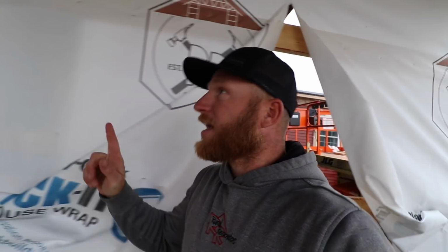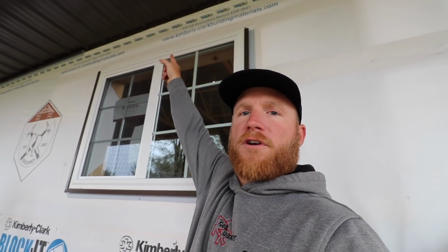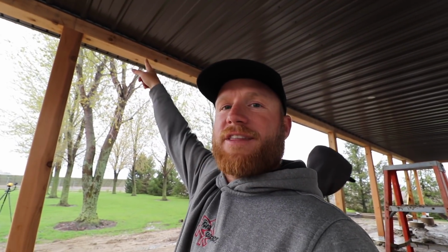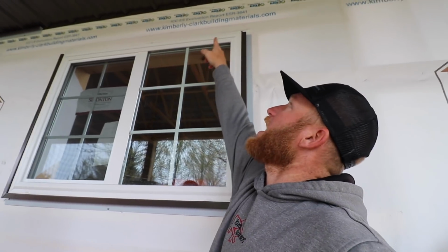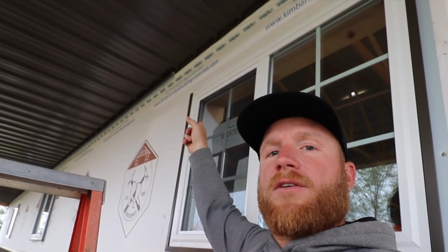I had a couple questions on how we manage steel up in the ceiling as far as getting it installed, because you basically have to trim out both sides, right? And you can't make the steel shrink and get it up there. So what we do, if you look up here, is we've got a piece of reverse colored angle way up there that we install first, and then we put our ceiling in, and we're only installing it into J-channel out here on the column. So we stick it in, push it tight that way, and then this trim up here makes it look fully finished. And what Greg's doing right now, you can look back here, is installing the J-channel that will accept our wall steel. So hopefully that answers that question.